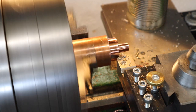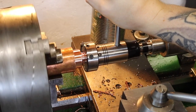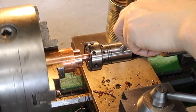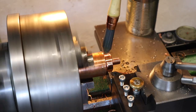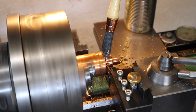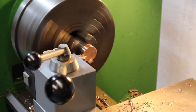Once I achieved 30mm, I turned down a small portion and chamfered it to accept the M12 thread, then power-fed the die in to cut the M12. Doing this in copper was really easy — not a lot of force back from the die — and it came out with a really nice looking thread. As a quick test fit I tried it into the hammer head and it threads in really nicely. To finish it off I stuck it back in the Damascus hammer head, using it a bit like a collet, and turned it down on the lathe, putting a chamfer on and facing it off.